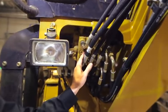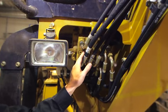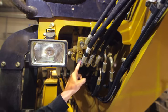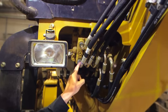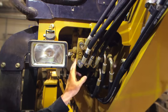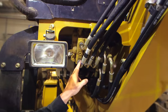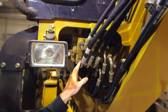A load sensing hydraulic system provides power on demand by lowering horsepower consumption and overall system heat. The proportional priority pressure compensating valves, shown right here, provide consistent, predictable movements of the implement cylinders, ensuring precise control when doing finish grading and other applications. The hydraulic flow is proportioned so implements operate simultaneously with little effect during engine speed adjustments or multifunction operation.